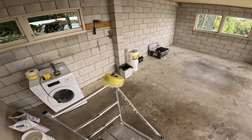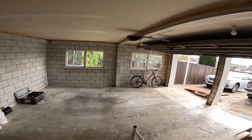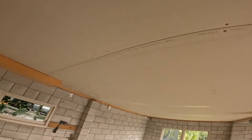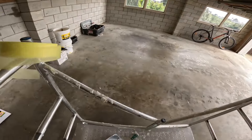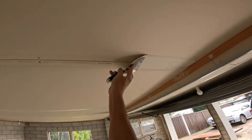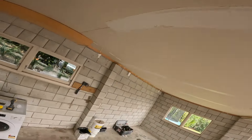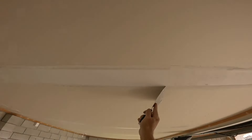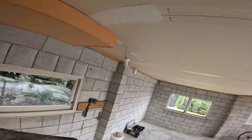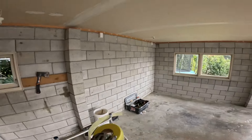Another good tip here — the board was a bit loose. One of the screws had gone right through the board so it wasn't holding. Just put a new fixing in right next to it. I like to check all the fixings as I go. Anything that's gone through the board isn't really doing anything — the screw head needs to be just sunk in below the paper. So we just pick up any of those as we're going — filling that recess, not wanting to see any board through the plaster, then applying the tape.